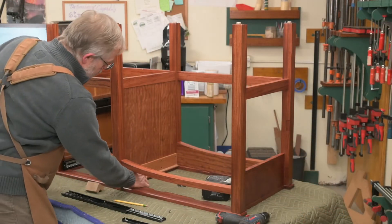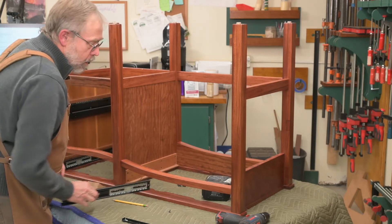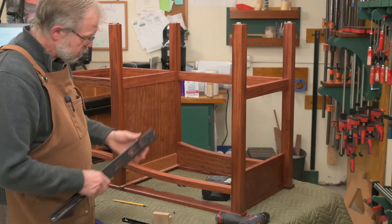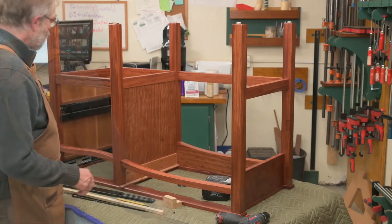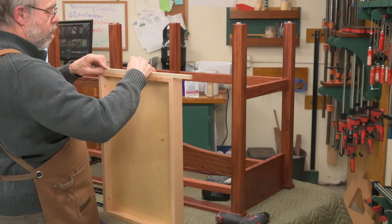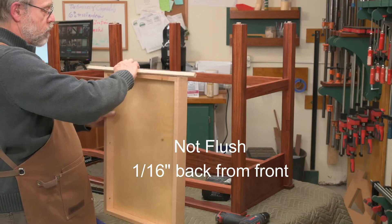The numbers are a little different — the spacing is three sixteenths off that point there at the top. But it's still one and a sixteenth back, same as the other. You'll mark that oblong hole and that one, pencil them, then pre-drill and mount the slide same as we did on the file drawer slide. To mount this on the drawer side we're going to be using a half inch spacer, and this goes flush to the front. So it's much the same, just different size spacers.